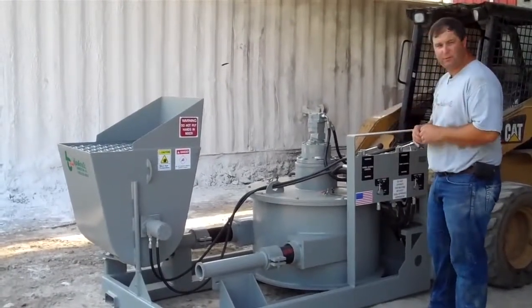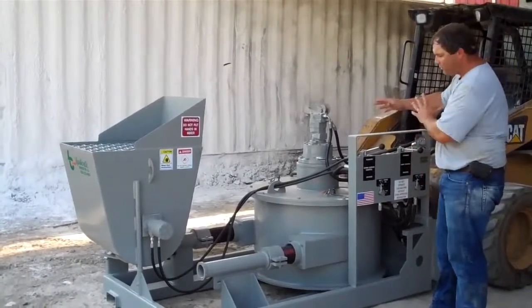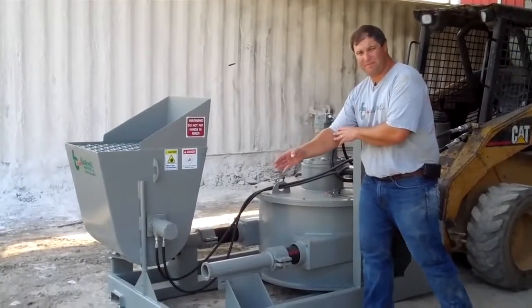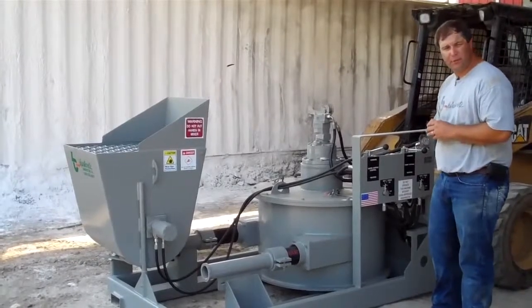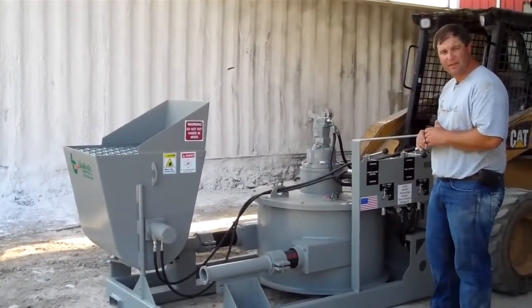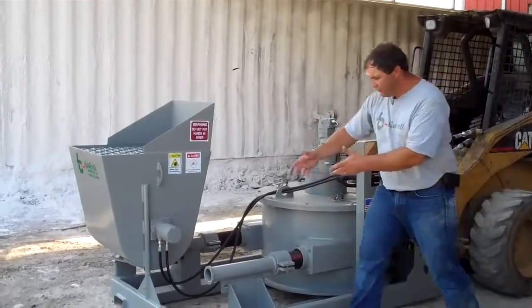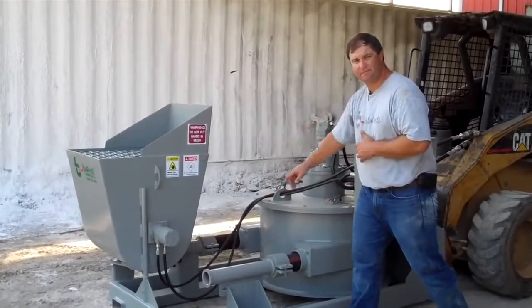So we've got a problem where we punctured our tube. We've got our clamps removed. The first thing we do is engage the pump in reverse. When the rollers start rotating in reverse, the tube will actually come out on this side of the pump. It will slowly move out. After we've removed the pumping tube from the pump bed, wash out any debris that's inside the pump housing. The next thing we do is get a new tube, put the pump forward, and feed the tube from this side of the pump back around to the receiving hopper.